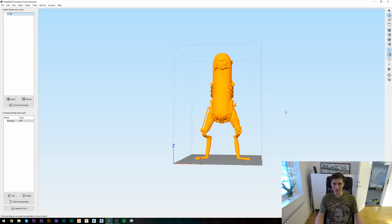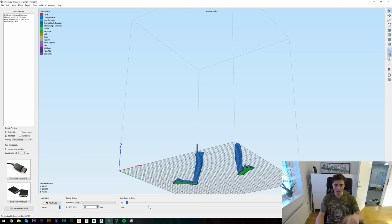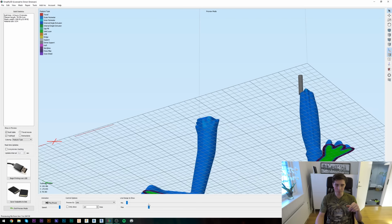So a 3D printer basically works by putting down very fine layers that build upon each other, and that's where this is going to be really difficult, because let me show you here. Just like I said, the printer works by putting down very fine layers, and as you can see, when it comes to this point, it's gonna have a really hard time putting down these layers because there's nothing to build upon, right? So this problem just resonates throughout the entire print.